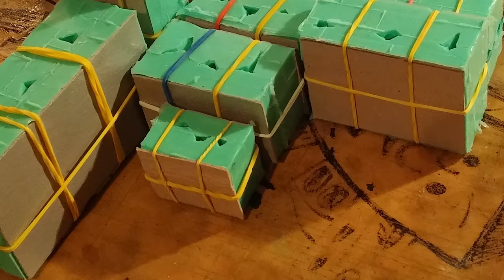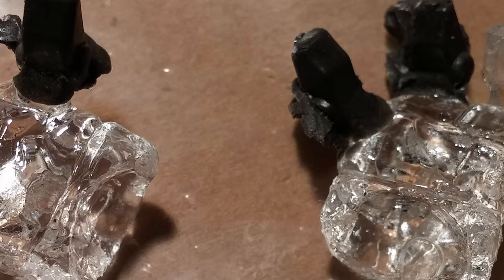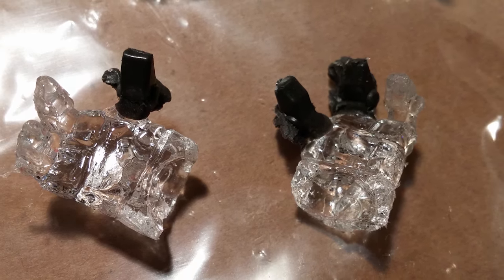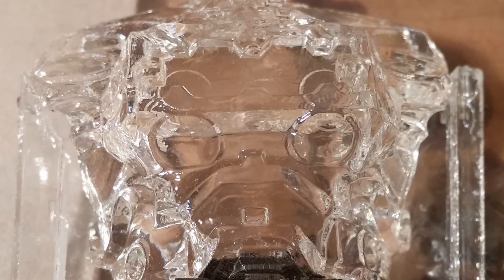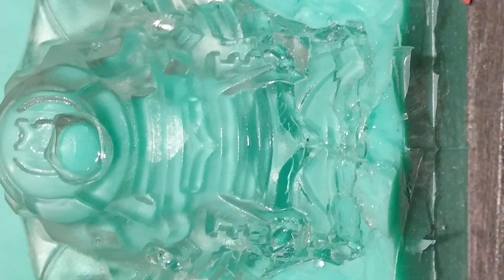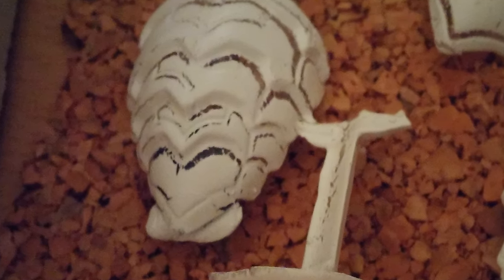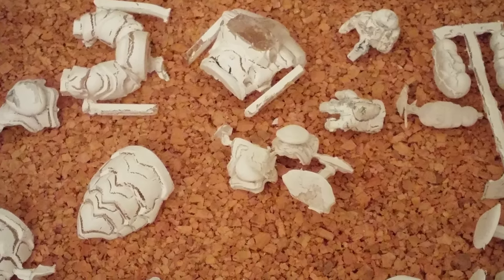Casting the parts turned out to be a real pain in the butt. I had decided for a clear polyester resin because it was a very clear resin with an almost crystal look to it, but it came with a lot of problems. It was really brittle. It gave me a lot of problems with bubbles in places where I really didn't want them. And then it also rejected my Army Painter primer when I first tried to paint it. It was a disaster. It took an eternity to get at least the parts for one prototype ready.